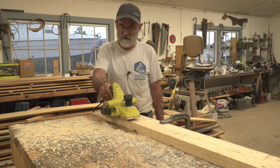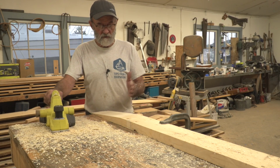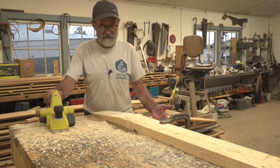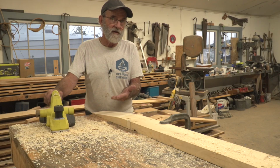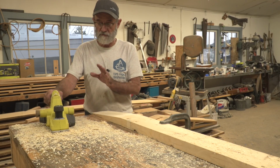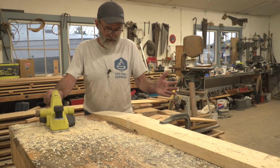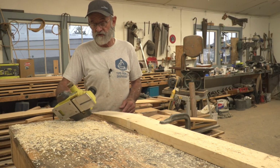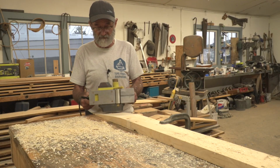Really, really nice. This is really a simulation of cutting scarfs in planking, whether you were on the bench doing it or under a boat doing it or otherwise. Usually under a boat, when you're on a boat, the planking is wet. And when it's wet, it hangs it up way more. This one will work really well whether it's wet or not. The other one won't work at all. So you have to make these alterations to it, and when you do, you have just about one of the most useful tools that I have ever worked with, ever.